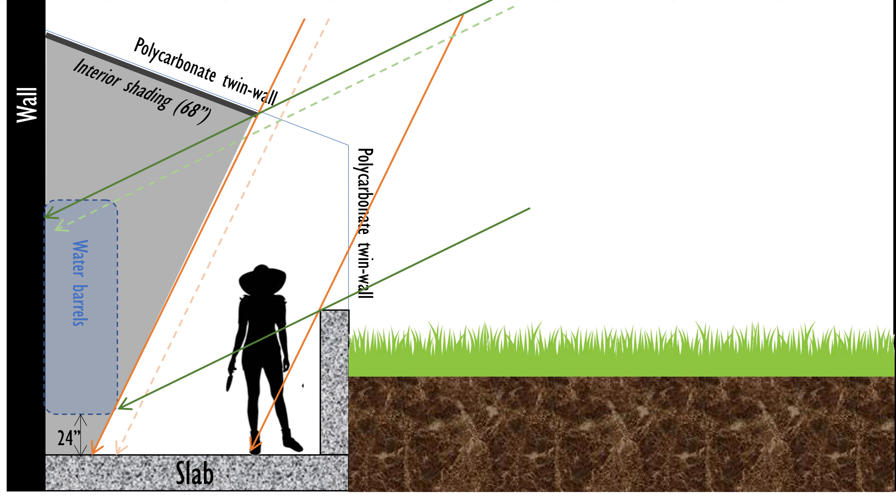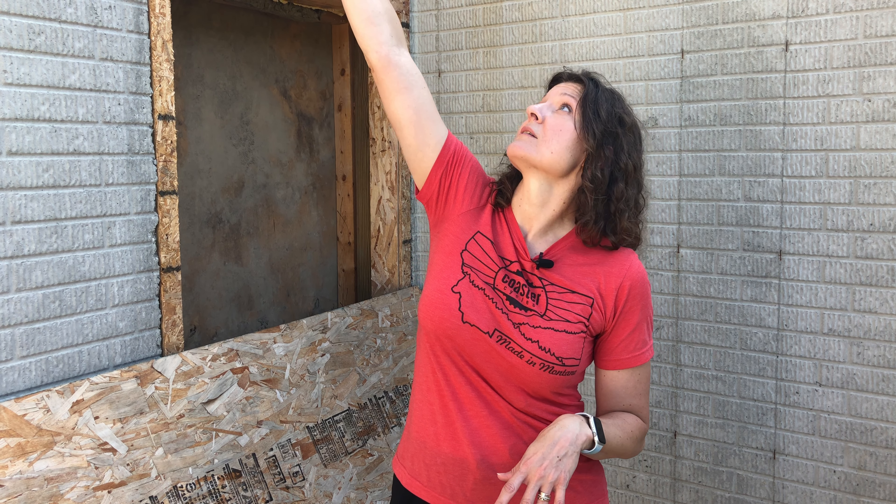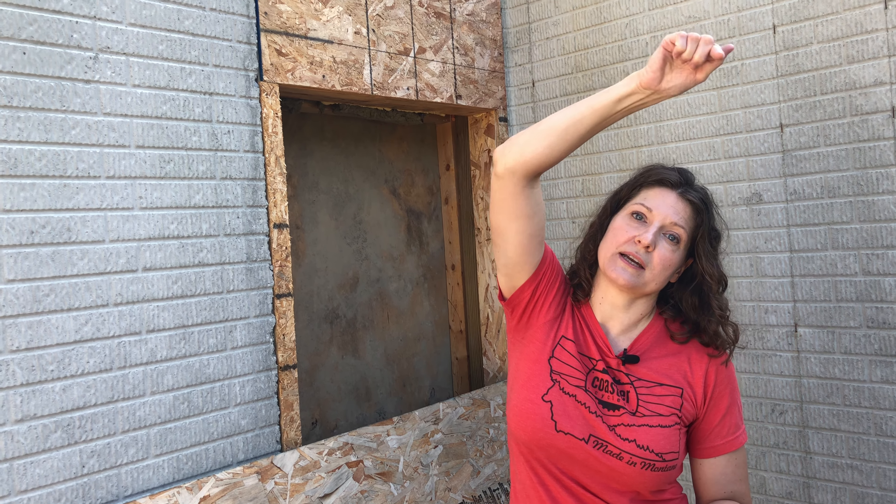Since the barrels don't need to go all the way to the ground and are going to be lifted up two feet, I don't have to cast quite as much shade. The dashed pale orange arrow shows my original shading angle; with the barrels higher off the ground, the solid orange arrow shows where I can now place shading and still not hit the barrels in June. That allows me a slightly shorter shading device — in my case, measured at scale, 68 inches or 5 feet 8 inches of shading applied from the top of the roof downward.